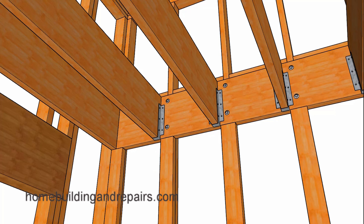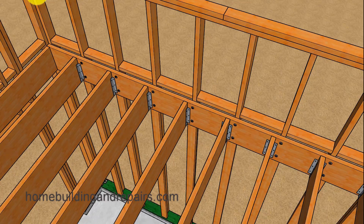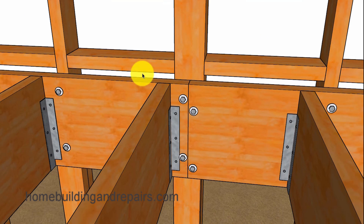For those of you who are new viewers, I need to point out that I am not a structural engineer and that you might need to consult one before building one of these projects. So keep that in mind when designing your project. Another idea would be to install a larger wall framing stud like a four by four where the rim joist breaks so that you can get a better connection.